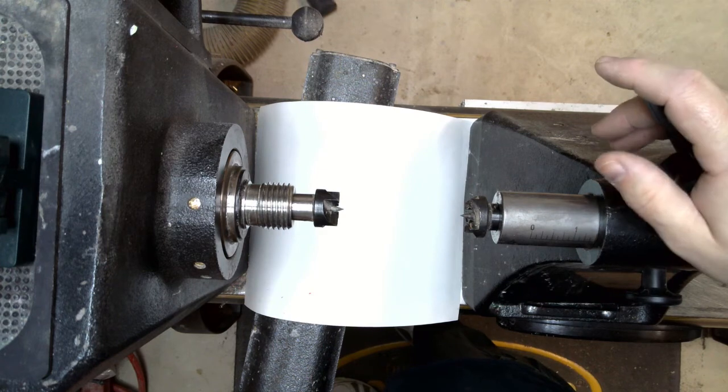So to wrap up — it's really two different things. Either you don't have proper mandrel setup, in which case I highly advise going to the turn-between-centers mandrel and making sure you use those nylon washers, or it's going to be your lathe itself. If it's your lathe, it's not that complicated to get it back into perfect alignment — check your owner's manual and check other YouTube videos to help you get everything aligned.